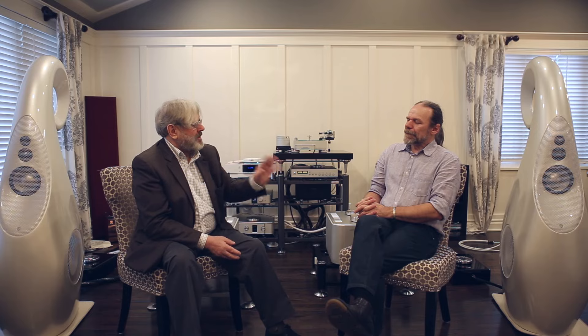The upper crossover point is at 3.5k, so we have about two-and-a-half octaves of margin before the first breakup. With a fourth-order crossover that's going to be something like 50 dB down at the breakup frequency — well out of harm's way. The G1 Spirit doesn't replace the G1 — it comes in above it.